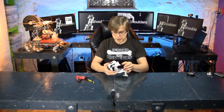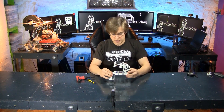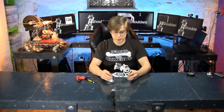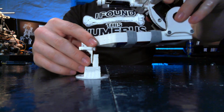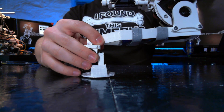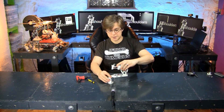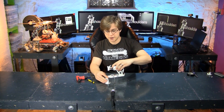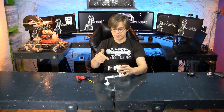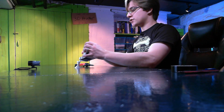The parts, as I said, I'm reusing as many as possible to keep the design simple. The battery is built into the bottom of the leg in order to distribute the weight evenly on the robot. As an example, when the leg is lifted off of the ground with the use of the servos, it's picking up one battery every time it does that. When it pushes down against the ground, it's picking up a few servos and the electronics that will be in the center of the DogBot. So it distributes the weight.